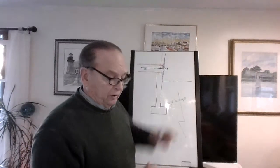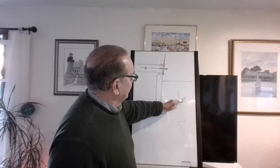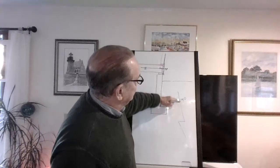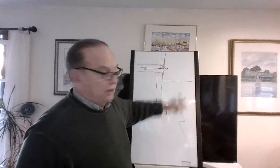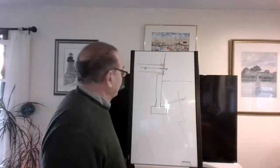When you put in a frost free and you get that plastic wedge that comes with it, use it. Don't toss it. Use the wedge, and what the wedge does is it counteracts the shingle angle and kicks this up in the air so that you're either pitched slightly out, which is what you want, or at least flat, so the water can't build up. Okay, now, that's all well and good.